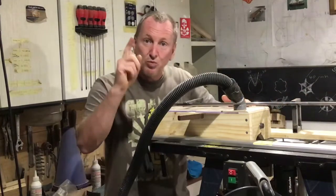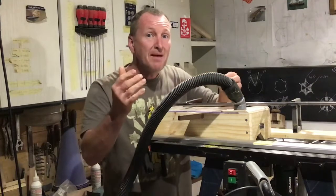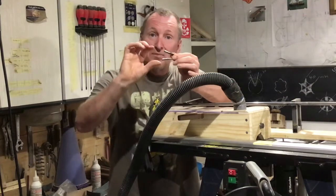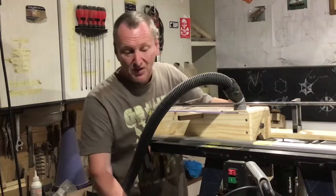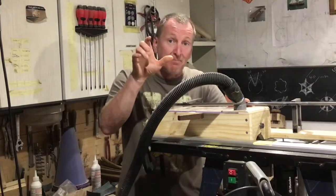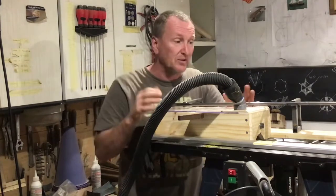Now it wasn't just one cutter, I've got 3 identical cutters, and I thought maybe that the shaft, the shank, has been machined slightly undersized, and when I tighten up it's not tightening up enough. But it happens with all of them. So from that I can only assume it's because I'm putting pressure on the top on one side and on the bottom on the other side it's working loose.